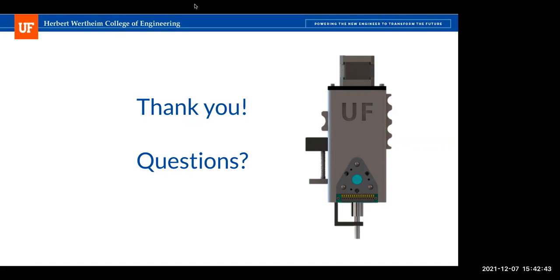Tom Singer from Northrop Grumman noted that the finger grooves are an interesting touch but may not add much to the design, since the device isn't intended to be handled regularly — it's more of an ergonomic feature. He suggested cutting those grooves to simplify the design and reduce cost. He also raised concerns about the ejector being significantly off-axis, and while he appreciated the buckling analysis performed, questioned whether the eccentricity of the load was considered in the column analysis.